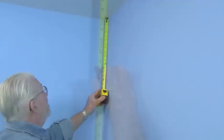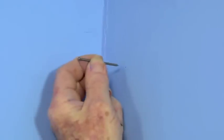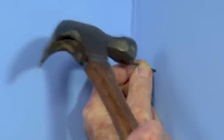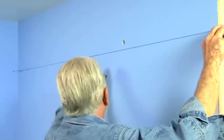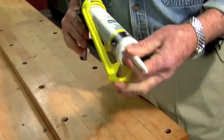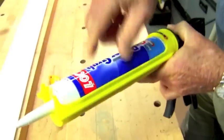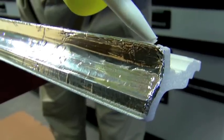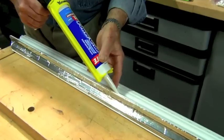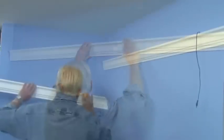To position the molding, I measure down the desired distance from the ceiling and make a mark near the end of each wall. Then I drive in a finish nail on one of the marks, loop the end of a chalk line over the nail, pull the line taut, align it with the mark on the other end of the wall, and snap a line. The lightweight polystyrene molding can be attached to the wall with standard painter's caulk or a high-tack caulk. No fasteners of any kind will be necessary. I just press the molding to the wall, double-check the position, make any necessary adjustment, and caulk the miters.